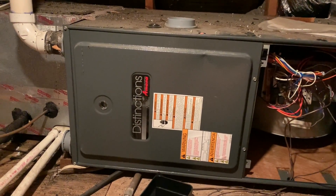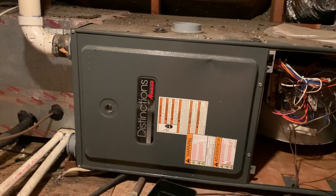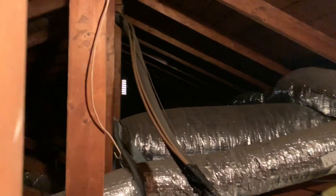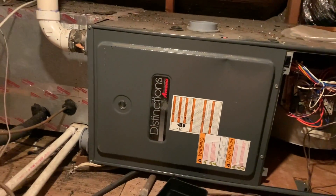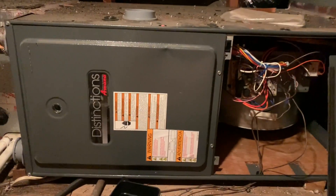Out at the air conditioning unit I checked to see that I was getting 120 volts — that unit is way back outside. Once you establish you're getting power out there, you've got to follow the wires upstairs. So I did that — I followed the wires upstairs.